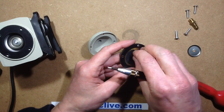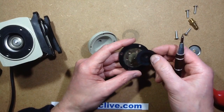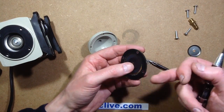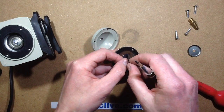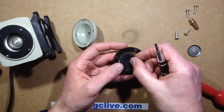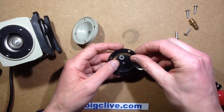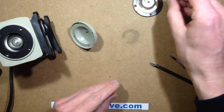When air is flowing in one direction, it just pushes the rubber flap out of the way. Then when the cylinder goes in the other direction, it pulls the flap back in again. So that's fairly simple — that's one of the one-way valves.